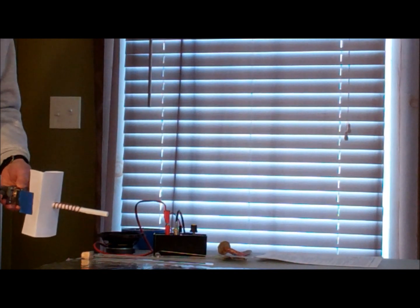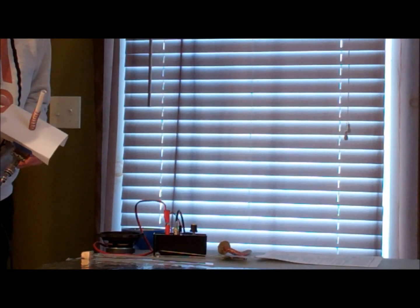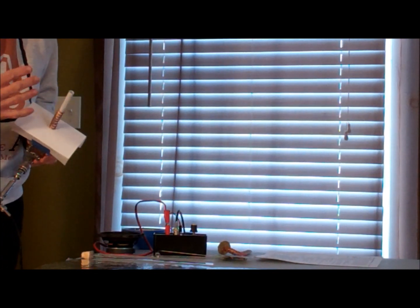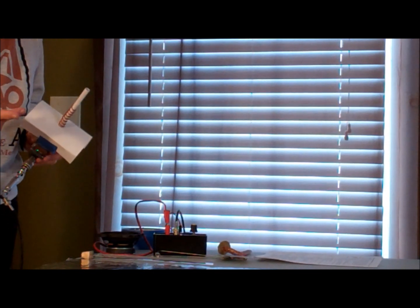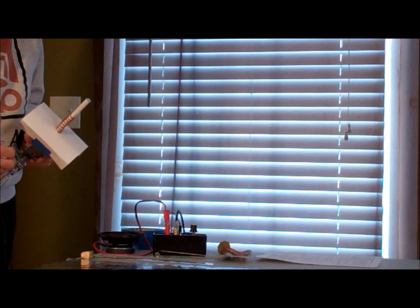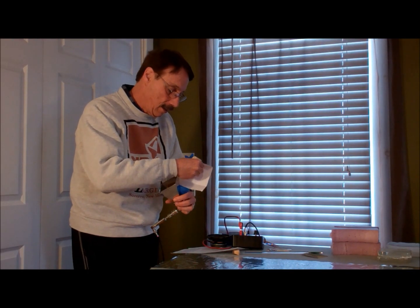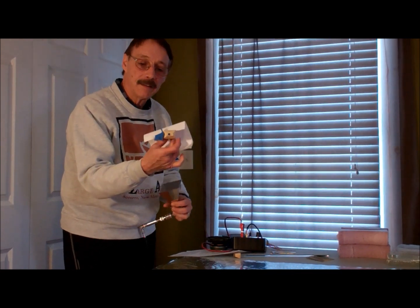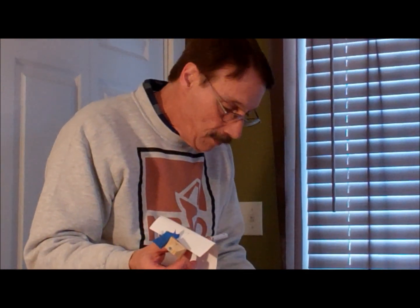It's not quite perfect, and you have to realize there's a huge impedance mismatch here so they're not lined up very well. I made these coils and they're not very well made — they're being held in with wood and paper. It's just basically a straw with wire wrapped around it and a piece of wood to hold it in place. Not a great way to couple these two together.